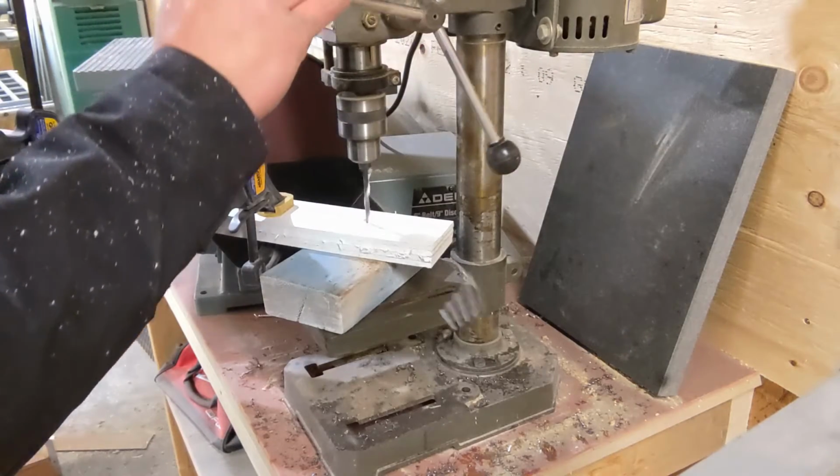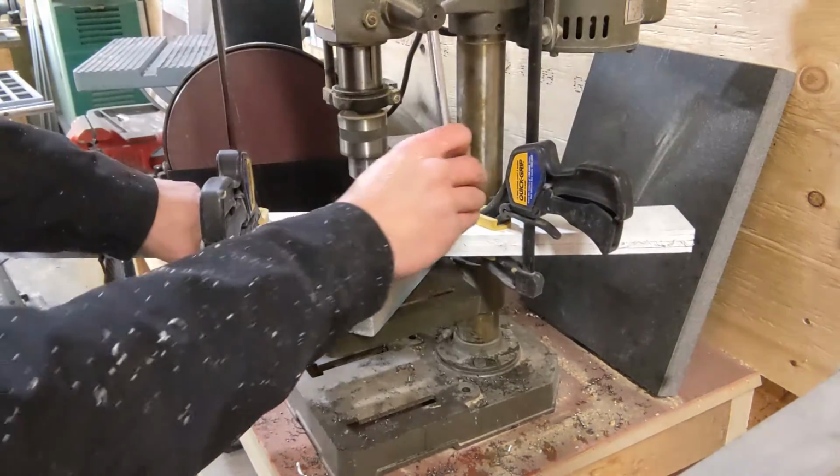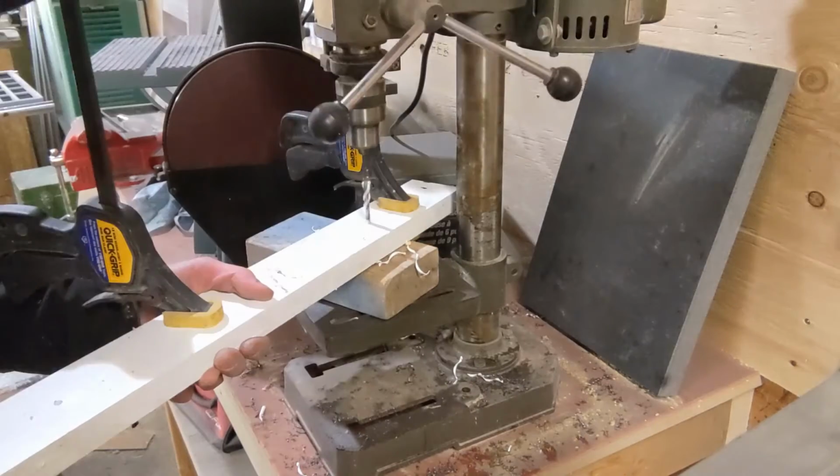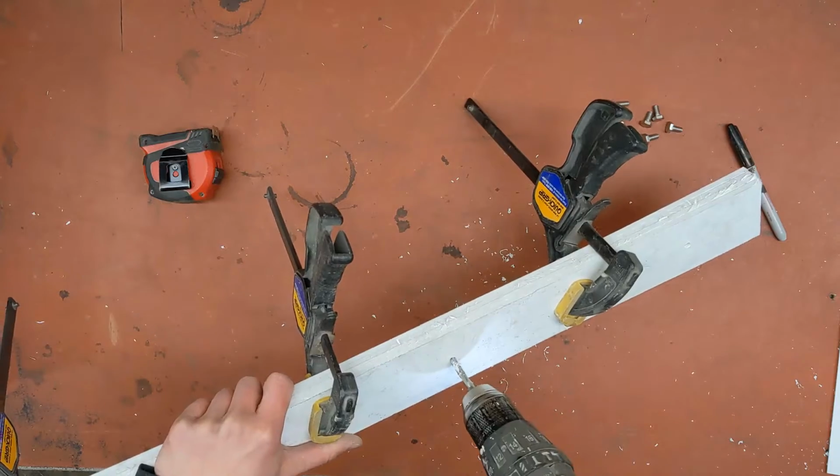I marked out roughly where I wanted the fasteners to go, and drilled them out on the drill press. The position of the holes is not critical, because I will use the plastic skis as a template to transfer the hole positions to the sled, and all the skis will be the same, because they are all drilled together. Each set of holes was tapped with a 1/4-20 tap.